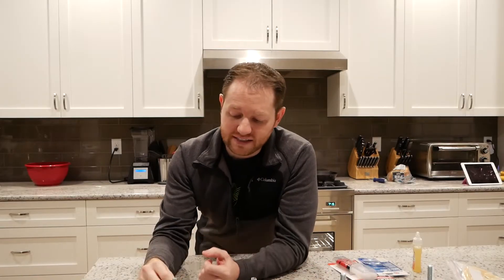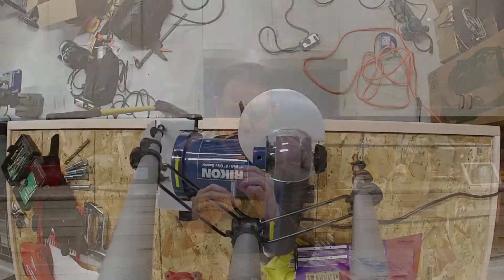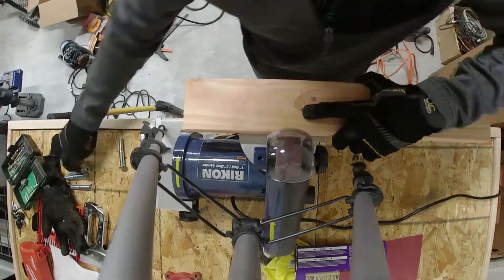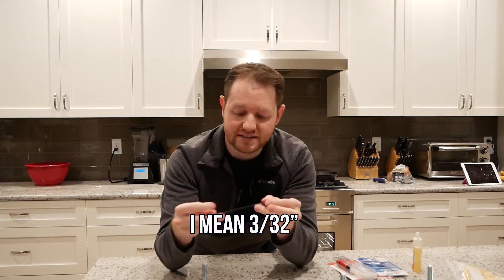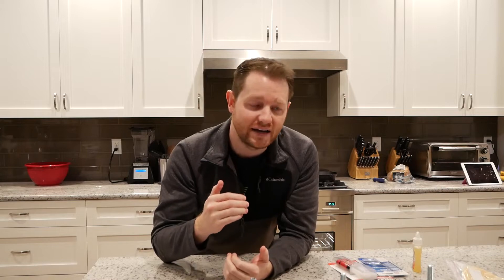To run this test, I have four half-inch bolts. They have some product markings on them, so I'm going to take these out to the grinder and remove that to get down to bare steel. Then I just have some cheap 3/16 float glass that I also bought at Lowe's. We're going to attach each one and then rig up a little test rig to semi-pseudo-scientifically figure out which one provided the best adhesion after 24 hours.